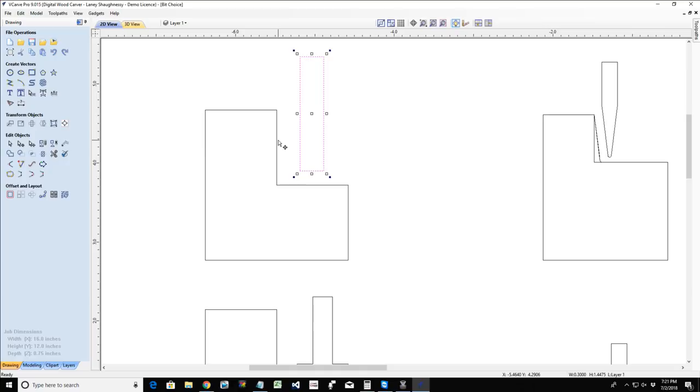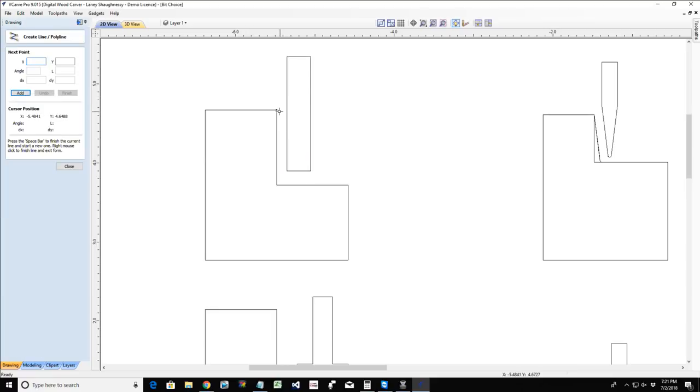Okay? So if my cut requires that material be removed, and I'm going to want straight walls and a flat bottom, I'm generally going to turn to a flat bottom bit, referred to as an end mill. This could be a straight end mill, which has two flutes and straight cutters down the side, or it could be a spiral where the flutes have a helical direction, an upcut or a downcut. Upcut means that as the bit is removing material, the chips are being thrown out of the cut up and away. Now, an upcut spiral bit has a tendency to cause chipping on the edge of the cut.